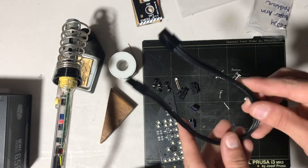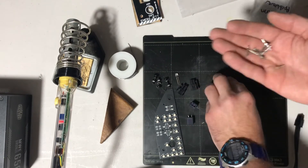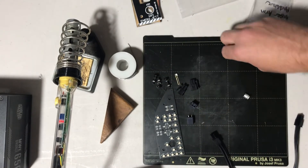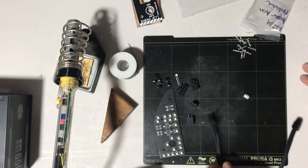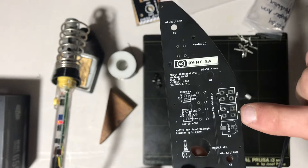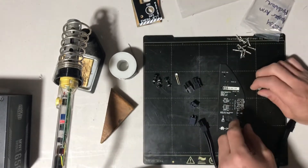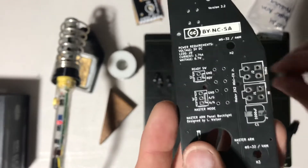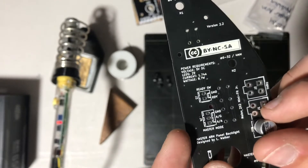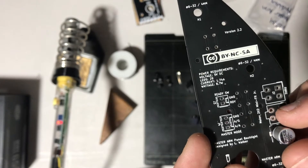I'm going to assume you know how to connect a cable and have a pre-terminated cable ready to go. If not, use up to 16 gauge wire, crimp each end with the connectors using pointy nose pliers, and off you go. Now flip the PCB over — you'll see two ports on the back: 'in' and 'through'. In is where data and power come in; through is the daisy chain out to the next panel. I'd recommend you do the capacitor first. There's a capacitor on here — optional but highly recommended for multiple panels or long panel chains, as it removes high-frequency noise and stabilizes the power supply.